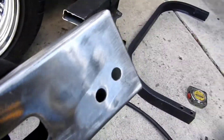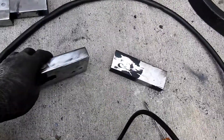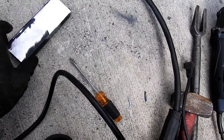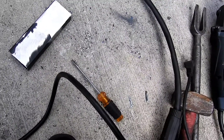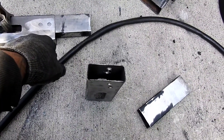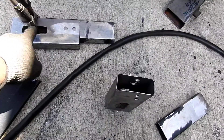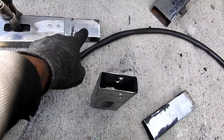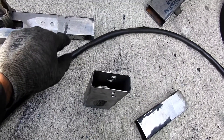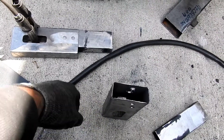Here's the pieces I cut off the end that are gonna get welded onto the end. Drilled out some holes so I can do plug welds. It's gonna slide in like this. About to do the two plug welds on here, then I'll do the plug weld around this part, then burn it in all the way around with both pieces combined once everything's slid together and measured perfectly.